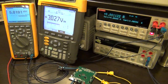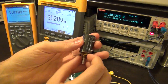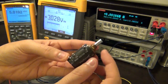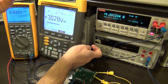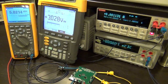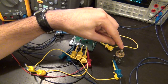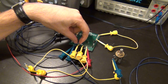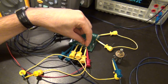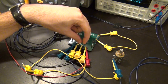What I'm going to do is connect a potentiometer. This is a 20-turn potentiometer from Helipot, which is actually quite good quality. It is 500 ohms, so I'm going to use that to have a controlled resistive load, and I'm going to measure the current that the unit takes using the Agilent 34401A.